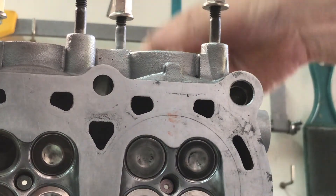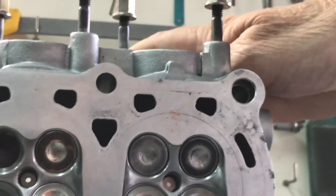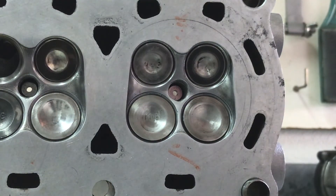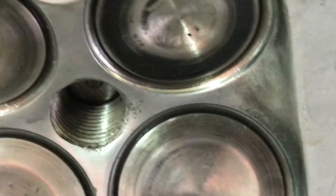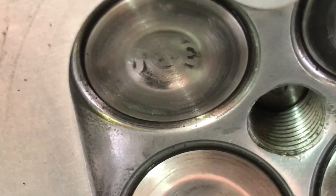We're in the process of waiting. You can see there's nothing coming through yet — so you might do this test and think wow, that's good, that one's good to go. Looking down the port, it's definitely got gasoline in there. We're starting to see a bit of a leak there — you see the yellow? You see the yellow collar coming on the seat. That gives you an idea there's a very slow leak. You'd probably put the liquid in the port and think yeah, it's great — but actually it's not.